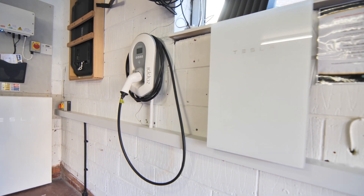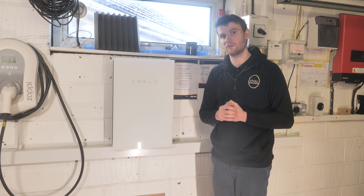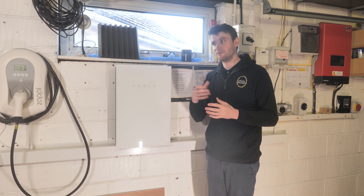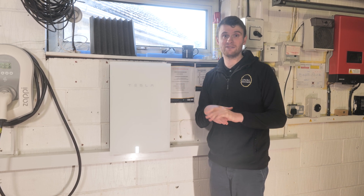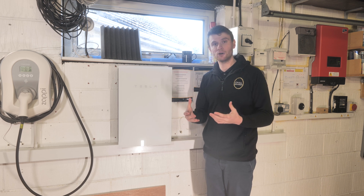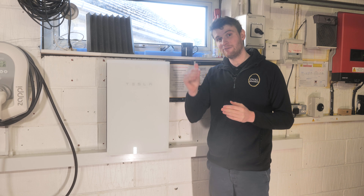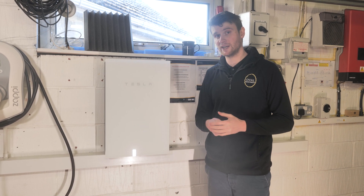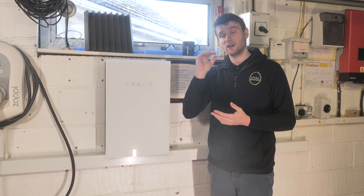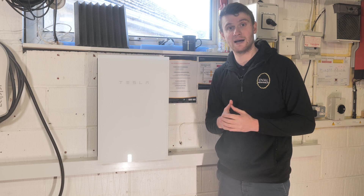This is very cool — the gateway also controls the system when there is a power cut. This is probably the best system for a grid-connected property if you want power cut protection. It will discharge up to five kilowatts into your home during a power cut, and for 10 seconds it can discharge up to seven kilowatts. If after that 10 seconds your usage drops to five kilowatts or below, the battery stays energized and keeps the lights on. We're going to do a little test of isolating the power so you can see how it works.